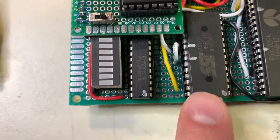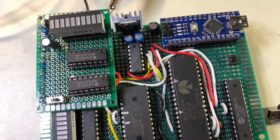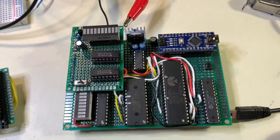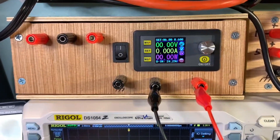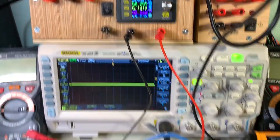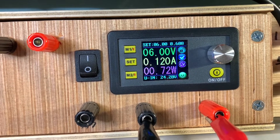There is a bus transceiver down here, which is mainly for this LED bar graph, but it also outputs to the pin-out here to ensure that the voltage levels don't drop too low depending on what's attached. This does run off of USB — it can actually run directly from the Arduino's power supply, but I also have another supply here with a voltage regulator so I can run it on 6 volts. It draws about 150 milliamps on average, jumping up to 200, but it varies depending on what it's doing.